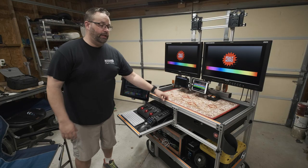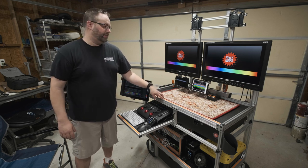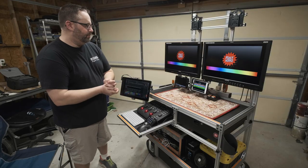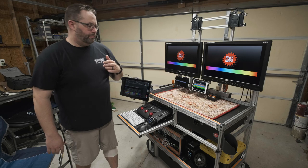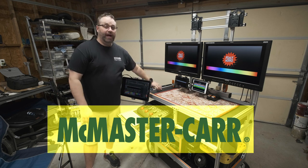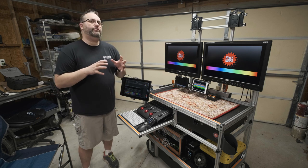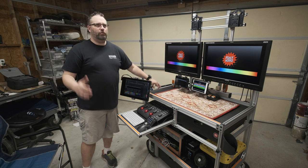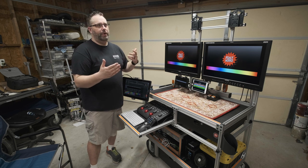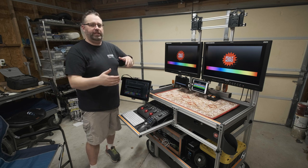I chose to build my new cart out of 80/20 aluminum extrusions — or T-slot, as it's commonly called. I have experience building with this stuff before: I've built another cart, some shelves, a platform to work on my motorcycle, and a rack underneath. Based on the ubiquitous nature of quarter-20 hardware, I decided to build it on a one-inch profile. McMaster-Carr sells this stuff, and their Atlanta warehouse is about 25 miles from me — I can order and usually pick it up within an hour and a half. I calculate the cuts from a maximum eight-foot length and assign those pieces to various parts of the cart.